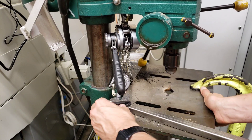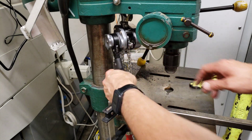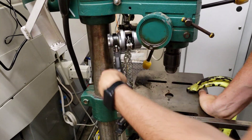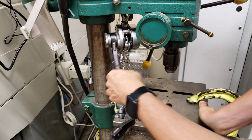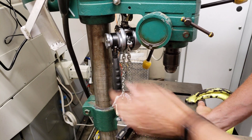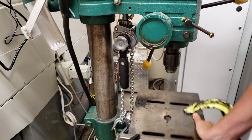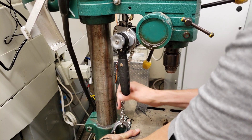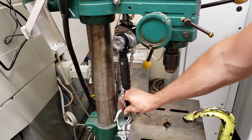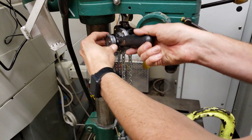That's awfully close — you would not want to be this close to the bit normally. To descend, flip the lever the other way and the table descends using gravity. This lets you control the descent. If it were heavy, you could just add slack and let it descend. If you want this to stay in place better, you could zip-tie it up here, but this is nice because I can take it off quickly. To raise the table again, just start cranking.